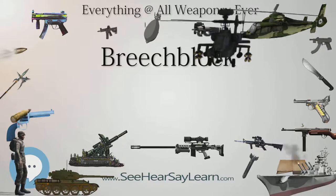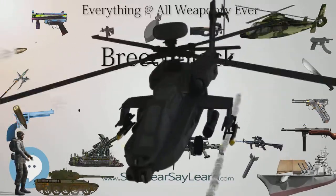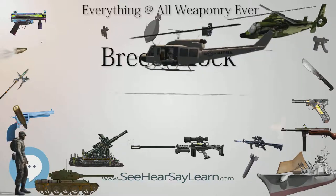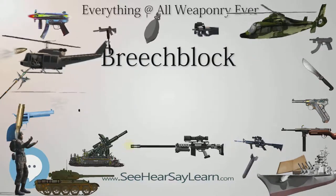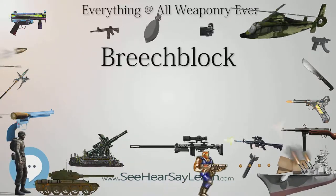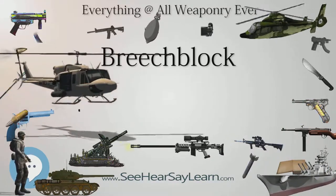In many instances, the barrel and breech block remain in line. In the Browning High Power and Colt's M1911 pistol, the barrel is tilted slightly to release it from interlocking ribs, so in this respect it may be likened to a tilting breech block, even though it is the barrel and not the breech block that tilts. This type of breech block configuration and recoil operation is not confined to pistols and may be found in machine guns and auto-firing cannons.